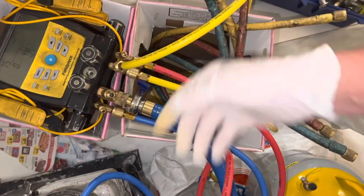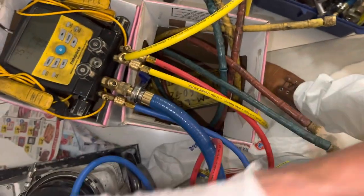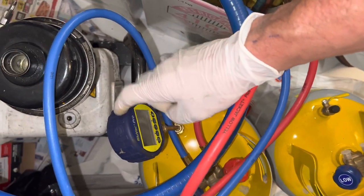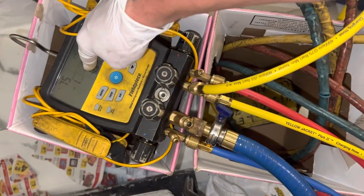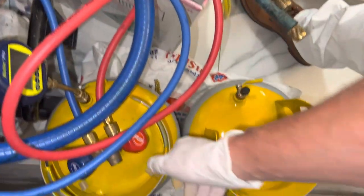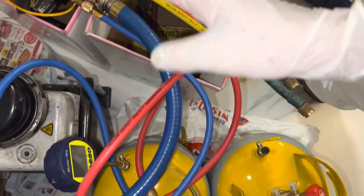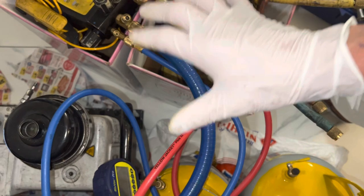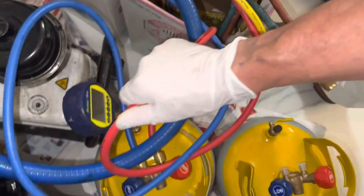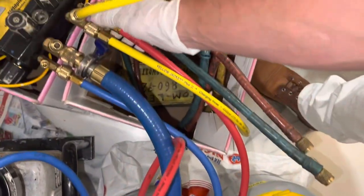This was a runner-up video you've seen before in this series — about using the BlueVac micron gauge in the field, about using hoses, and the difference between a known good clean tank as a test tank to confirm whether you have a problem with your system on your job site, or a problem with your connections — maybe rubber O-rings or your seals at the end.